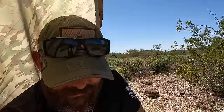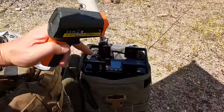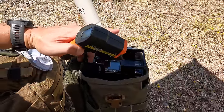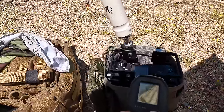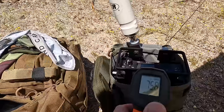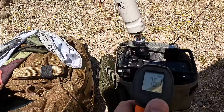One of the objectives was to see how this little guy dealt with heat. I've got the heat gun here. It's approximately 12:15 local time, and I found that most of the heat actually builds up right at the top of the head unit and at the top of the main unit — we're reading 75.9 degrees, so we'll call it 76 degrees for right now. We're going to take measurements this entire time. The hottest that I typically will operate here in the summer, usually in August, is around 110 to 114 degrees ambient temperature.